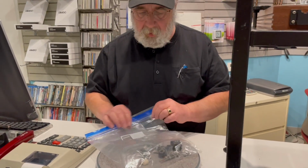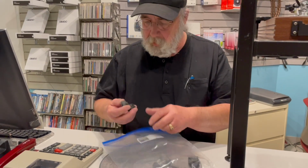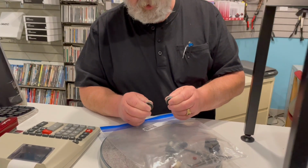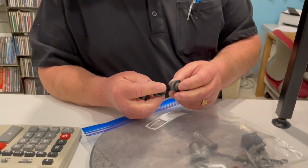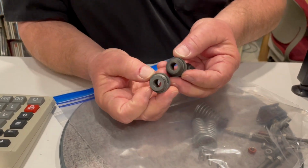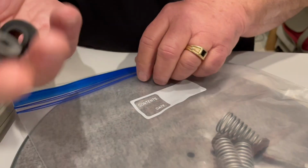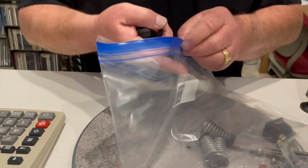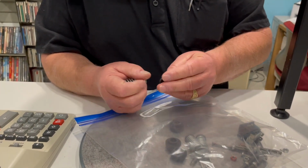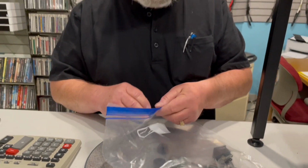When you're talking much older Linn LP12s, the grommets themselves are stiff. They're not doing their job properly. Trying to tune with these things is a nightmare. Here you can see they've been on there so long, you can actually see the spring rings. And you have grommets at the top, you have grommets at the bottom, and these things are just so far out of spec that it's just whatever.